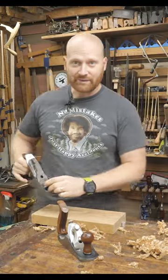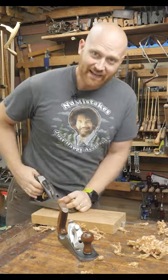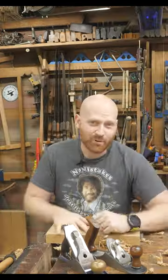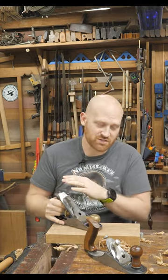Now this is the very reason why you need a lower bench — so that you can put more down pressure on it. You can get your body on top of it and actually plane with some down pressure into it. Personally, I'm a little in the middle: I like my smoothing planes to be crazy sharp, but for all the other planes in the shop...